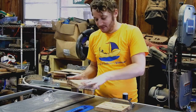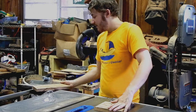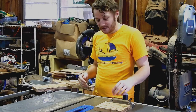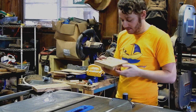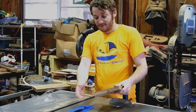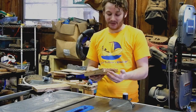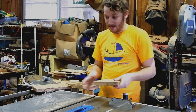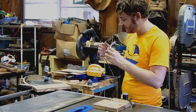I think I'll get all four sides of this box out of these two pieces, and I want to connect them with 45-degree angles. Something I've done before that works pretty well is to cut that 45-degree angle on my boards before I split them into two pieces, so I know all those angles will be perfect and I won't have to set up stop blocks and all that.